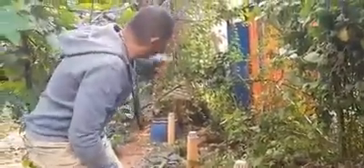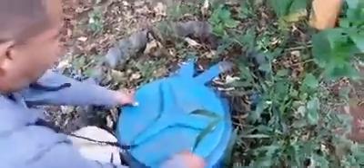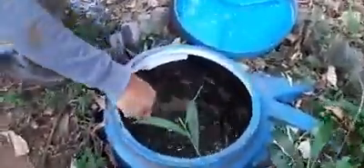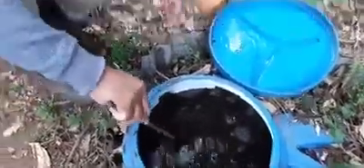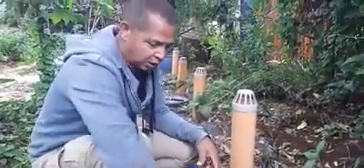You're never going to get fresh waste reaching the last chamber. The last chamber — the light blue one — contains biofertilizer. It's very liquid, with no solids at all. There are even mosquitoes in here, which shows it's fairly clean. It doesn't smell like sewage — it has a slightly earthy smell but not at all like waste.